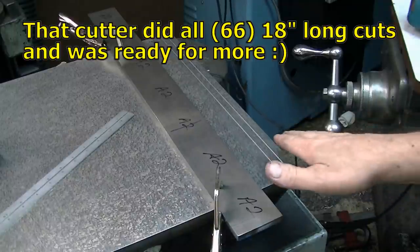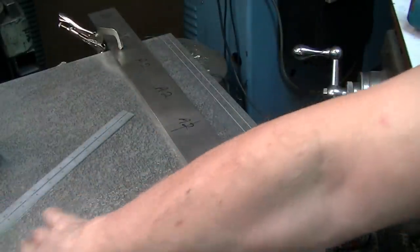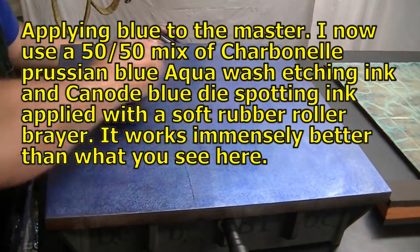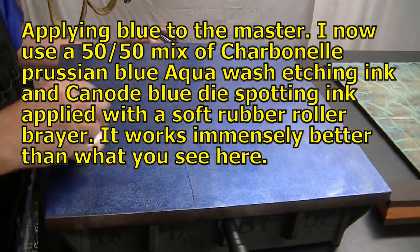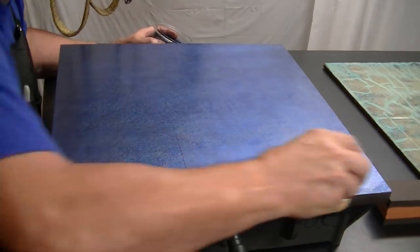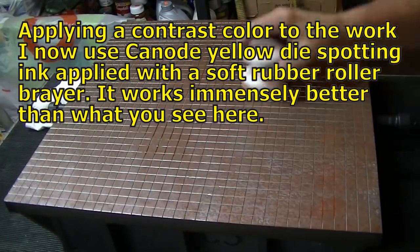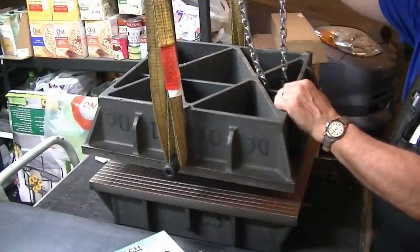So I'm going to do the pattern all the way across. Obviously, I'll have to flip and do it the opposite direction on the last little bit where I clamp the straight edge. And then I'll do it the cross direction. Very important that you have a uniform layer that doesn't have any blobs or whatever, because those blobs will turn into a bearing that is not really a bearing. Okay, letting her down to get her first rub.